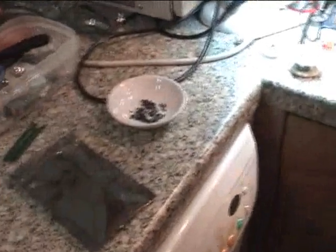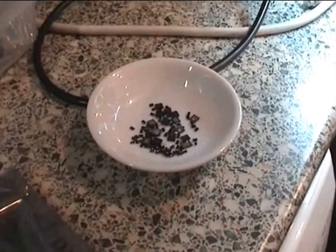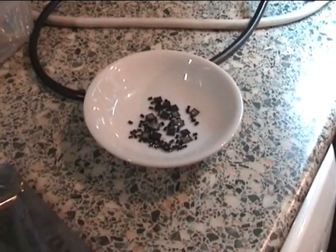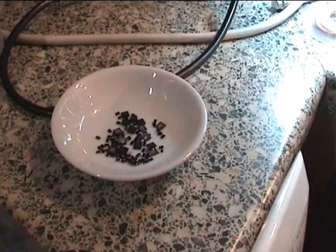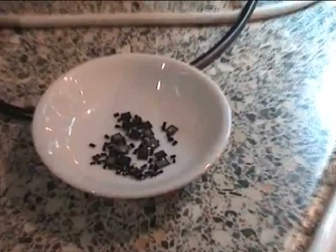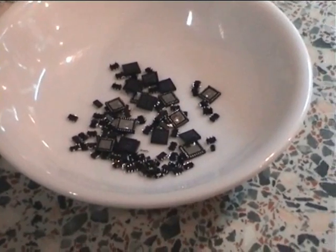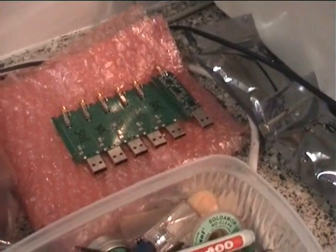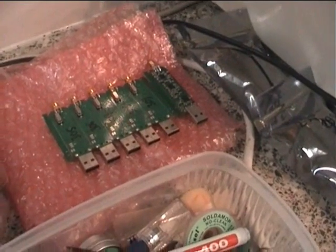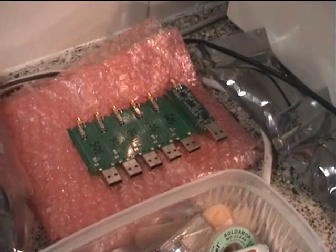What you might be able to see down here is the results of the rework that I've had to do on the last hundred or so boards that have come in from a manufacturer. I've had to individually test each one and there are quite a lot of parts in there. This is mostly a result of voltage regulators failing. I've got six more boards to test, so I've done 94 boards so far, fixed them and got them working.